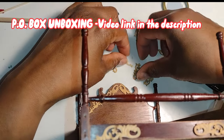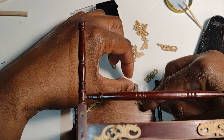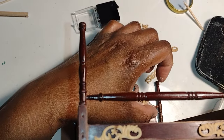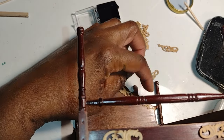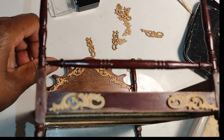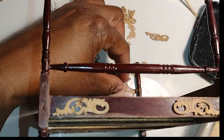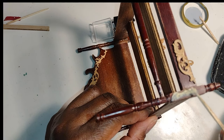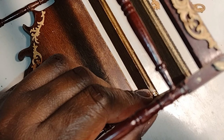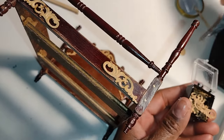I'll leave a link in the description from when I got this wonderful gift. I'm just playing around with the little wooden pieces to see how they'll look on my bed and how they coordinate with the lovely curves already on the headboard. Your creativity really blossoms in the midst of play. As I played around, I noticed there are some little holes at the end of the headboard where they were attached to the old bed frame previously. So I got my putty to fill those holes — this is just some basic wood putty. I'm pushing it into those little nail holes so I have a smooth surface when I do my final paint treatment. After packing the holes nicely, I wiped down and cleaned up the excess, then packed them again because sometimes the putty shrinks, and finally sanded the little areas smooth.